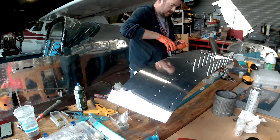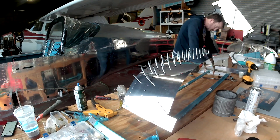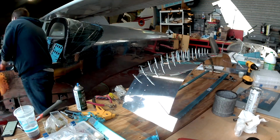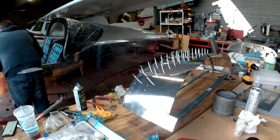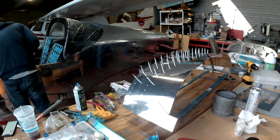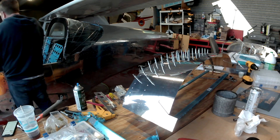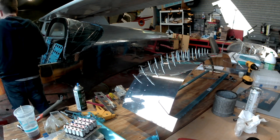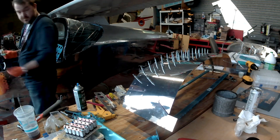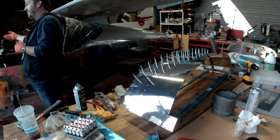You can see the two blue bars that just got put across the bottom. Vans sends three of those, made specifically for just this — they're spacing bars. We're making this big large curved piece that has to fit exactly. The first time you put those bars on, Vans says you may have to squeeze it together to make it click and go together, and they're right. The pieces don't naturally want to fit the shape; they want to be flat and you have to squeeze them round.